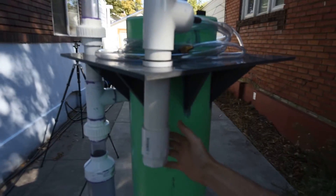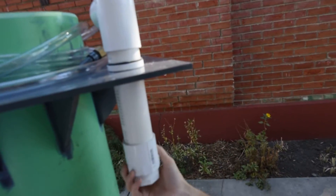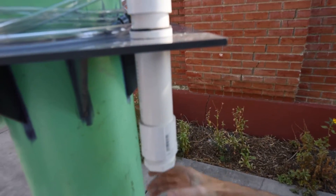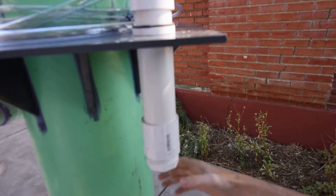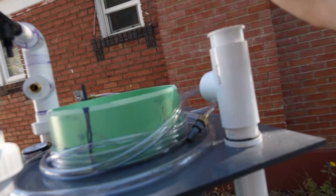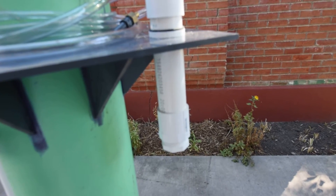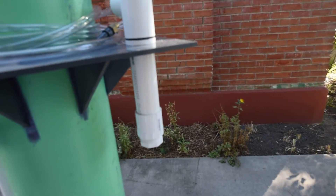The one last section — I've ordered another piece of two-inch tubing that I will connect here. This will be the skimmate collection cup; there's a half-inch pipe that comes off here with a little drain valve. So there's actually no longer a cup at the top — it flows over. This is your skimmate collection, and given that this is a continuous process flow, there will be a valve on that to allow it to flow out to a collection pond. So there you have it — we're going to go ahead and fill this thing up, make sure it holds water, and do a little bit of pressure testing. It turns out my hose bib runs at 100 psi, so that should be all that we need. Thanks, out.